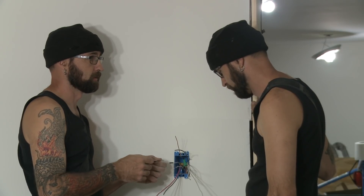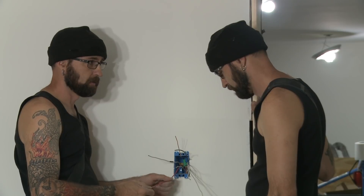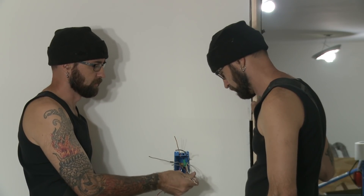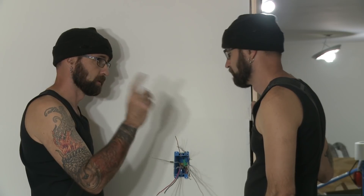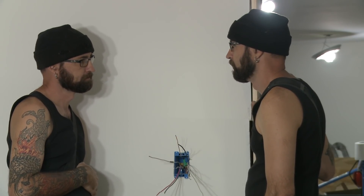The hot light from the panel hooks up to the white wire — it's actually a black wire running along the 12-3 switch leg to the other side of the room. It returns on the black and red to the bottom of the switch. Your two white neutrals go together in the back of the box, your black hot leg goes to the light, and don't forget your ground.